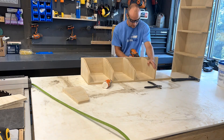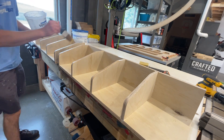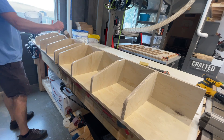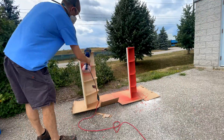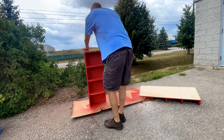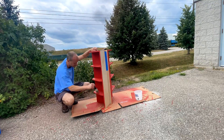To make the plywood panel edges smooth and ready for paint, I've mixed up some wood glue and water and I'm coating all the edges, giving it a filled-in look. It's also common to do this with MDF — when you cut it, you've got that fibrous, sandy edge, so it's good to pre-seal it before painting. Now I'm using my sprayer outside — and this is the second mistake of the project: the wind got the panels, one landed on the asphalt. I smartened up, put them side by side, taped them together, and repaired the damage.